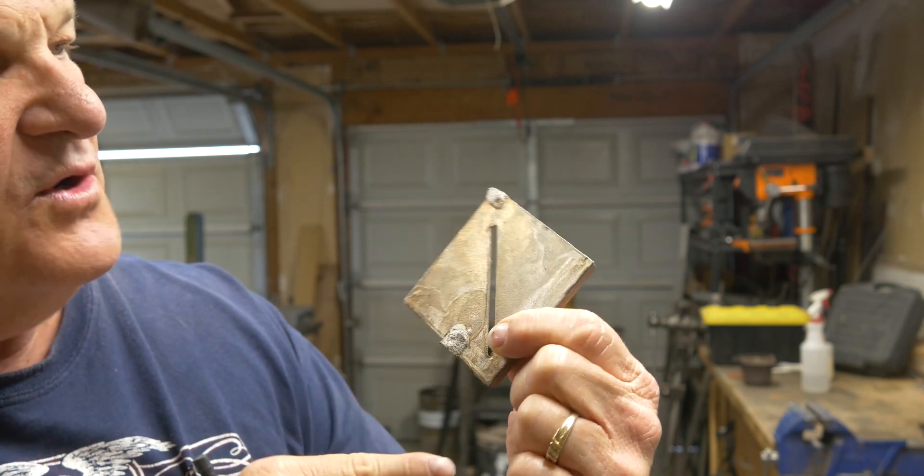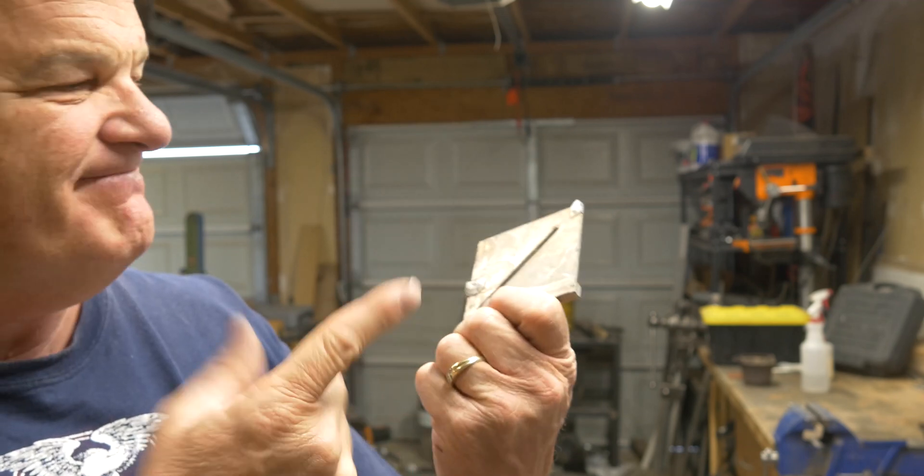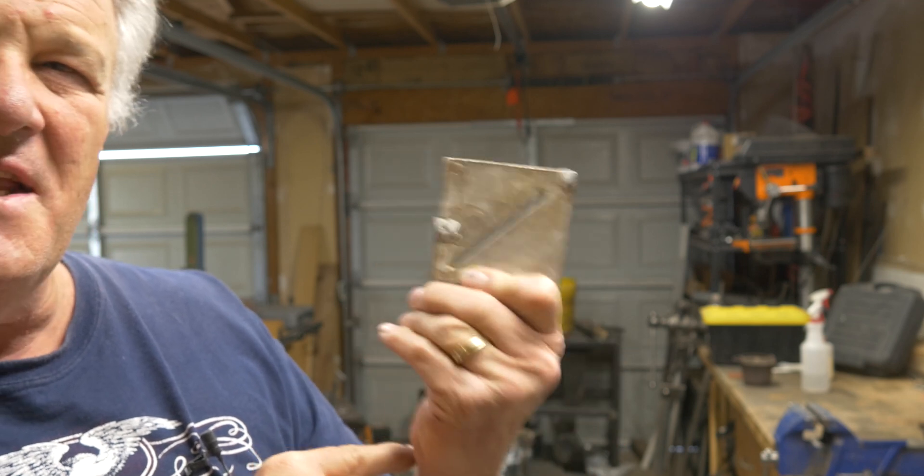Big old fat vents. This is a part I made some time ago and on the back side I can see — let me zoom in — right here and here, I don't remember which was the in and which was the out, but this is not great because I've got this big blob to cut off. Why go through all that extra work? So let me show you a couple of new ways I've been using — scratch vents, and then a wire poke, poking a wire down through the mold. I'll show you both techniques in the next clips.